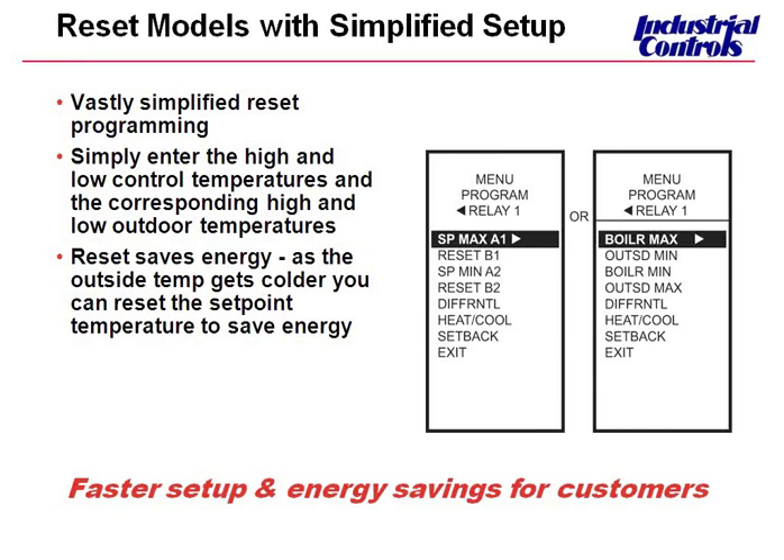This is terrific because now you can see your actual set point, and you can also see what the output is — how many relays are running or what your modulating output is — so you can tell if it's working properly. If you look at the boiler reset menu and keep hitting enter, it takes you step by step from boiler max all the way to exit. Once you hit exit, the controller is programmed. One important note on the differential: when dealing with the modulating output, the differential is factory set at 20 — this is a proportional band, not a temperature differential, and it prevents short cycling. However, that 20 also carries over into the relays, where it becomes a 20-degree temperature differential. Most people don't want that, so you'll want to reduce it back down to 2 to 5 degrees. That differential screen is very important and should be adjusted accordingly.